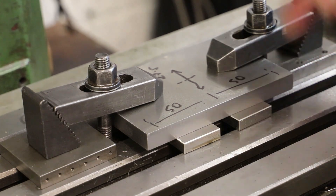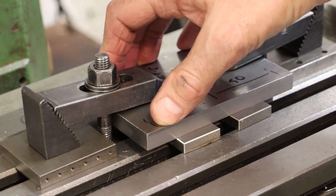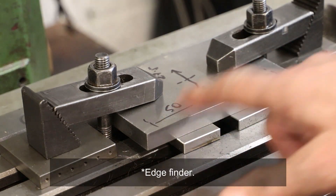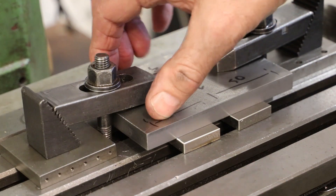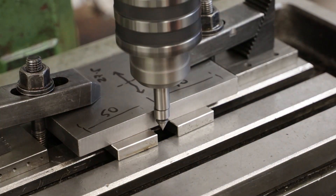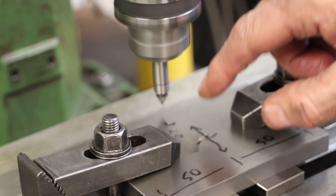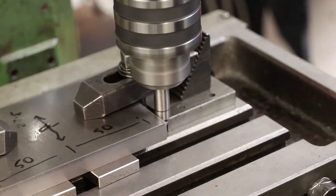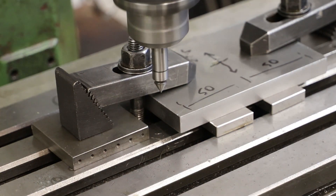The workpiece is now square on all four sides. Next I'm going to drill the four holes for the mounting bolts that come up from the top slide bed. I'll use the wiggler to find the centre of the workpiece, and then from there offset 50mm either direction along the long side and 27.5mm along the short side from the centre to get the centre points for those four holes. With both the front and back edges found, I've set the centre on the DRO at zero, and now the centre is found for the X axis as well.